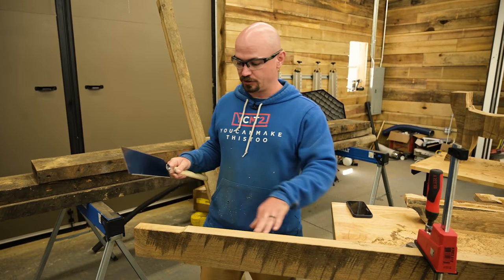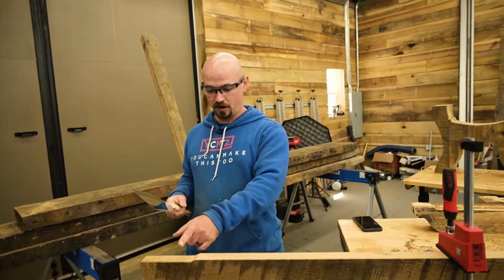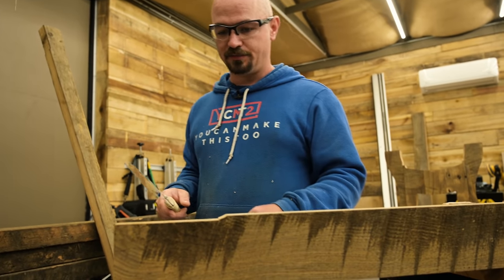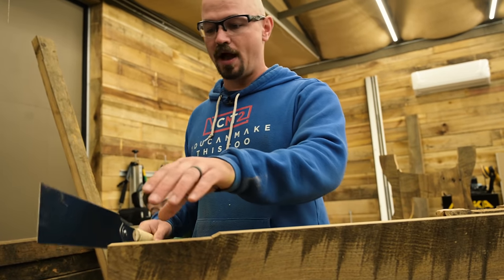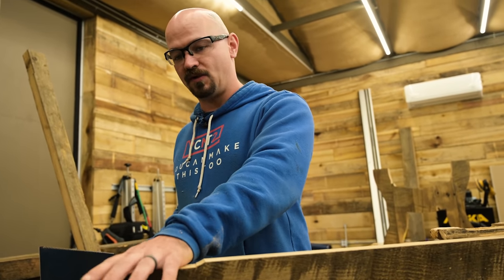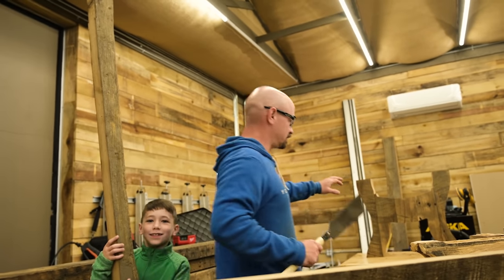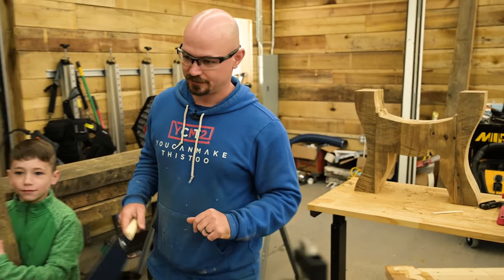So this piece still has some character, it's gonna look good. So I went to the jointer and used the jointer to establish some shoulders. And now where my cutter head left a little roundy bit, I'm just nibbing this off with the saw. And now we'll have a square, definitely a rectangle that we need to cut out of the CNC. It's gonna be a lot easier to establish the mortise on the legs for that stretcher to go through. So I feel a lot better about this.